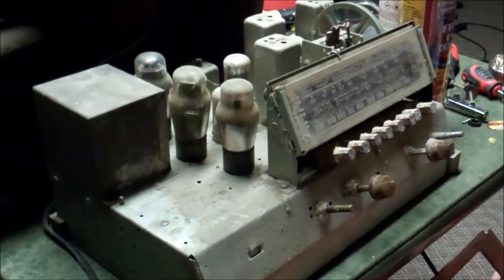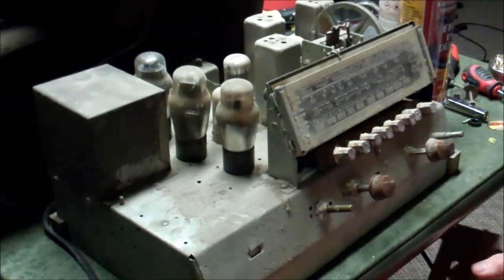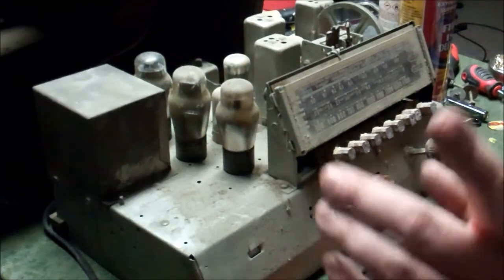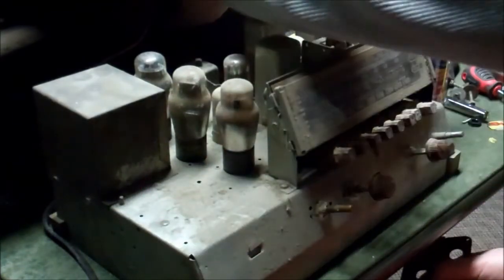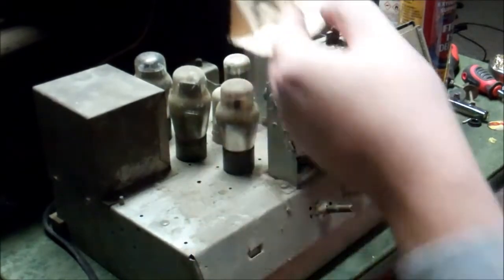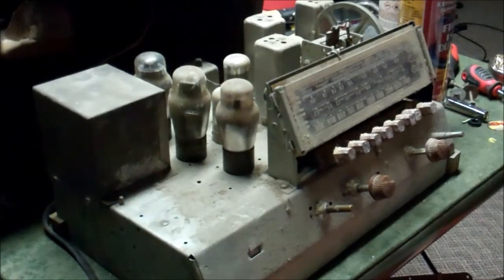Thought we'd take a look at it and have a little bit of fun with it. It's pretty much what I had expected — we have a potential radio coming back to life, but it will need filter caps. I was told it worked before they put it away. I said, how long ago was it put away? And it was about 30 years ago. So we're looking at like 60-year-old filter caps — they're not feeling too well. Humorously enough, underneath the chassis I found a thing from Jim Holton's Radio and Television in Columbus, Ohio, so that may have been where it came from or was purchased at one time. Thanks for watching.